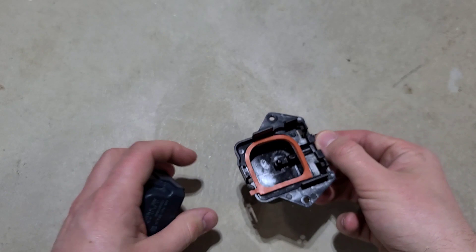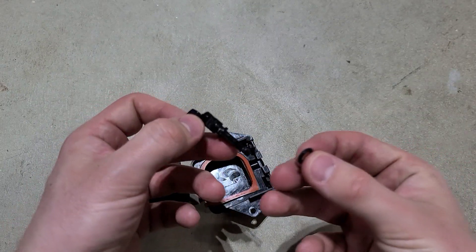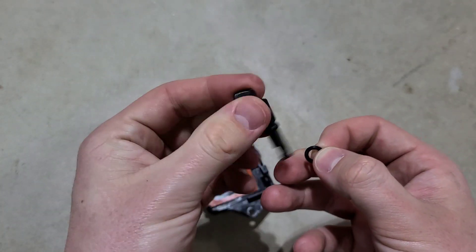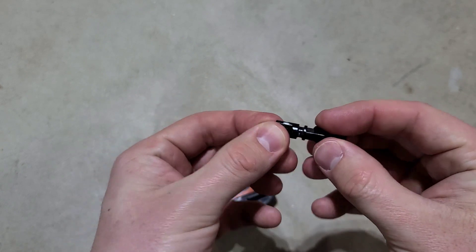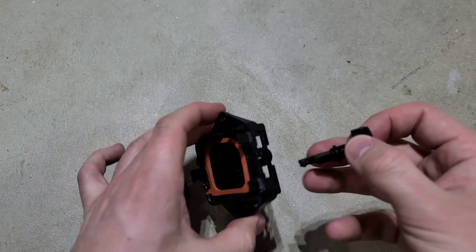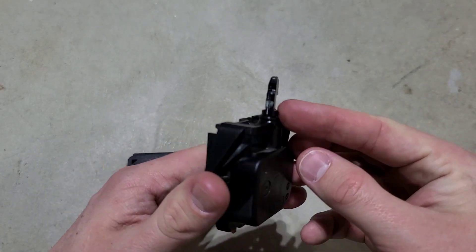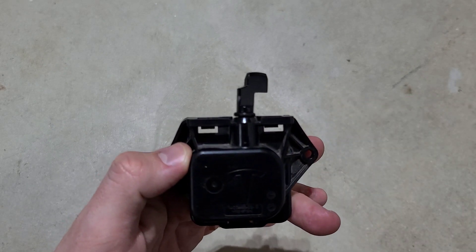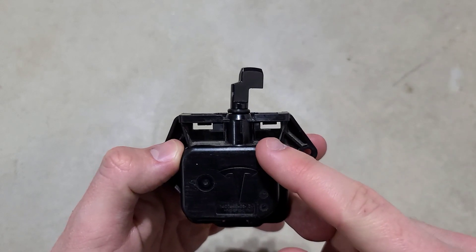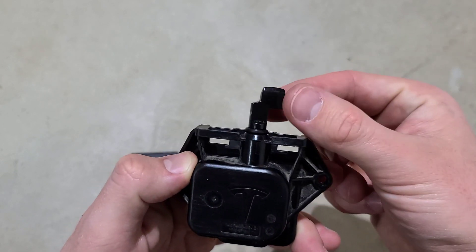The one piece I actually left out is this o-ring. As you can see, this o-ring is very overstretched and very worn. What ended up happening is when this shaft was moving up and down through this housing, the o-ring was expanding much more than it was supposed to, and by doing that it was rubbing up against the inner walls, preventing the shaft from moving up and down.